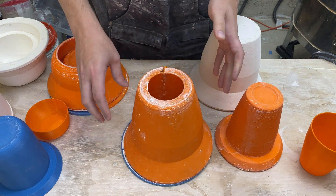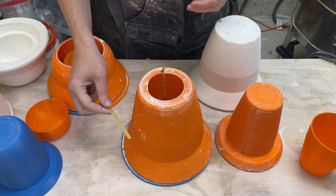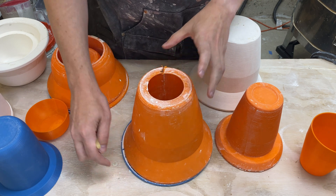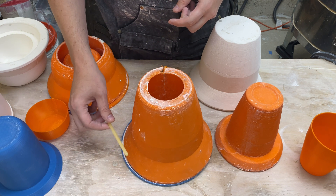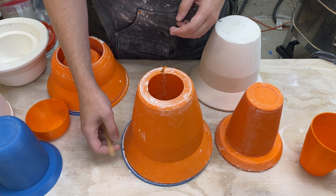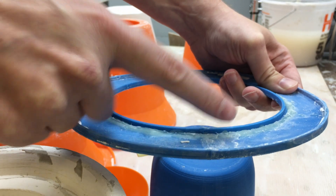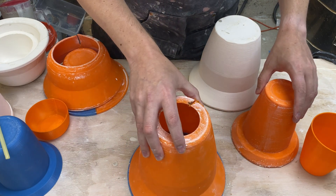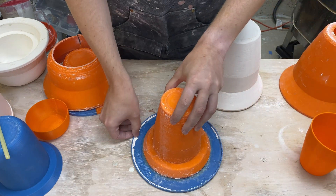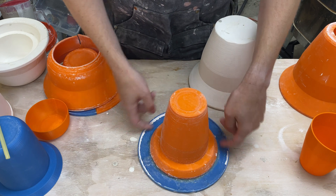This ring is designed with a little bit of extra tolerance — slightly bigger than the diameters needed on the outside and slightly smaller on the inside so they can slip over. There wasn't quite enough room, so I want to make that a little bit bigger. I then attach these together with sticky wax. I've seen this used in other model making videos; the idea is to melt it in the slight gap between the two pieces. It takes practice, and I wound up with a little bit of leaking plaster.